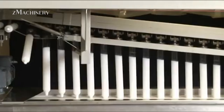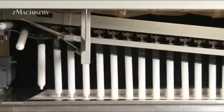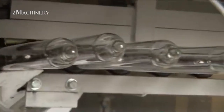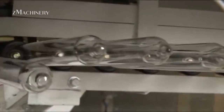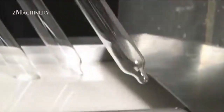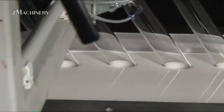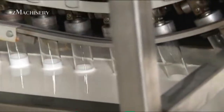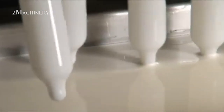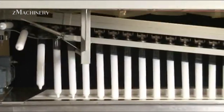Dipping. In a clean, high-tech production line, hundreds of glass or ceramic molds shaped like phalluses are first washed and disinfected. These molds are then dipped into the latex mixture once, twice, or even three times depending on the desired thickness of the condom. Each layer must dry and cure before the next is applied, creating a smooth, uniform film.